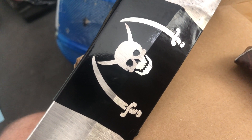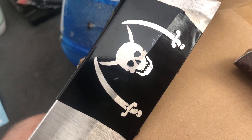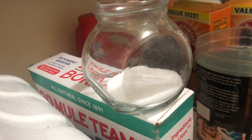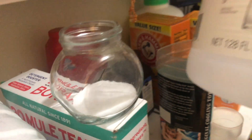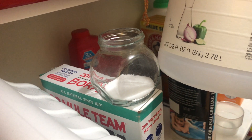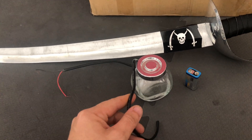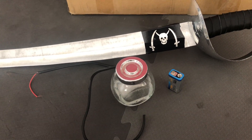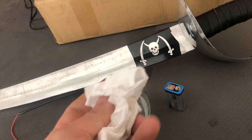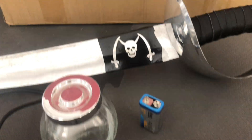Now I'm going to etch that metal using the battery and acid technique — my mild acid technique. I have a little white distilled vinegar in a glass jar with about half a teaspoon of table salt, just enough to make my own little acid etching solution. My materials are: a piece of scrap wire with red and black leads, a piece of paper towel to soak up the vinegar solution, a 9-volt battery, and my sticker ready to go.